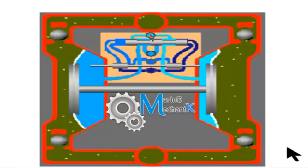Now the main air inlet is this, and here is the main air outlet or drain. This is the pilot air inlet and the pilot air drain. The main air to the diaphragms is controlled by this spool valve, shuttling between the left and right. And the pilot air supply to this spool valve or the main valve is controlled by this long rod. We will go step by step and understand its function.